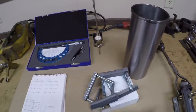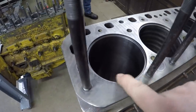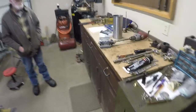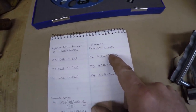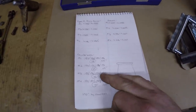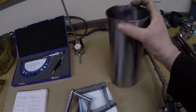We should be pretty well set up now. We did all our measurements to determine how much interference fit we had between the sleeves and the block bores. You can see we've done a little bit of work on number one bore; all the old stripes are left in the other three. The stones and that hone leave a really nice finish. We've already sized number one sleeve to that cylinder and got our routine down. Before we started, we measured the block bores and the OD of the sleeves and found we're running anywhere from one to two thousandths press fit. A lot of guys in the comment section said they like about half a thousandth, so at least we knew how much material to remove. The block counter bore measurements versus the upper shoulder thickness on the sleeve indicate our protrusions will be in the five to six thousandths range, which should be good.